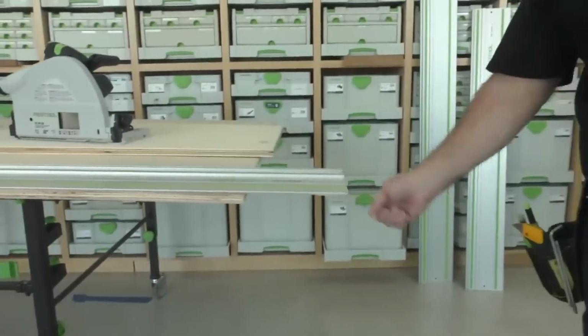So when I calculate them, I always use one of the track saws with the guide rail, except if I'm working with flooring. So if we look at a 55, the depth of cut of a TS55 is what? 55 millimeters. It really isn't. Subtract 5 millimeters. The thickness of the rail is 5 millimeters. So I know this almost by heart. It's 1 15/16 inches depth of cut with the 55 in the TSC 55.